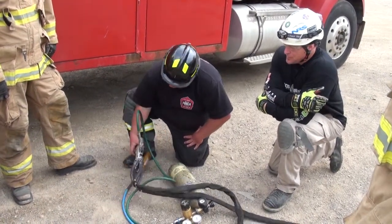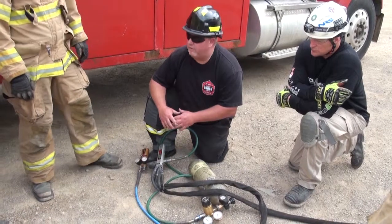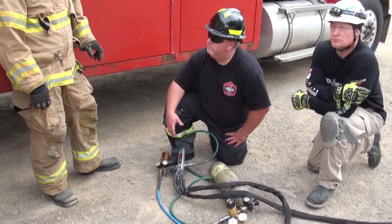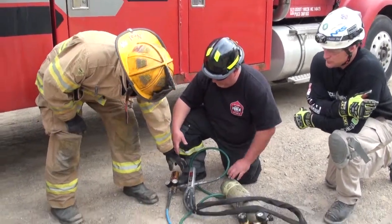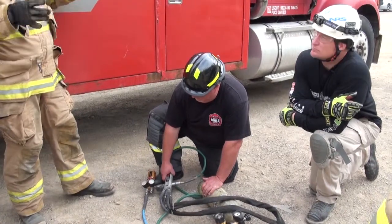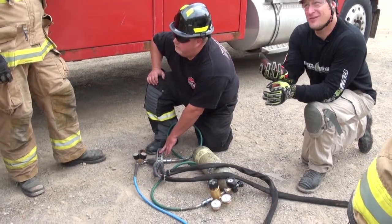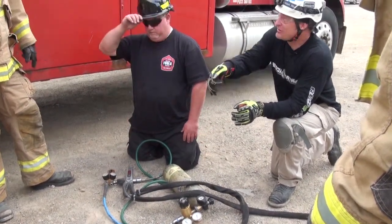When you're depressurizing and going down, you always have to hold the red button. You want to depressurize those prior to — do you want to keep the weight on the bag and not the strut? It is a specific sequence. When we get ready to come down, you're going to hit and hold the red button to release the pressure and the locks that are on the struts. The struts are locked because they're at that 1/25th of an inch travel with resistance. So to take that load off, you've got to go up on your airbags first. You've got to go up on your airbags to get the load off of the strut.